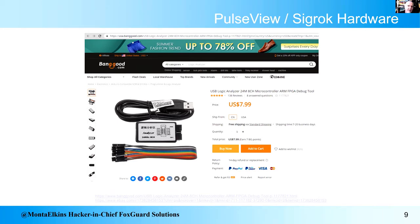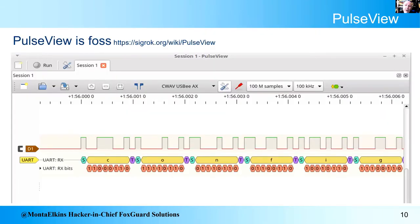Normally you're just getting the receive channel, but as I'm debugging I want to see transmit too — the reason you see the characters you type is because they go out to the device and get echoed back. This logic analyzer made it possible, and it turns out it made some other things possible too. It has associated open source software: PulseView for GUI, and the command-line sigrok.